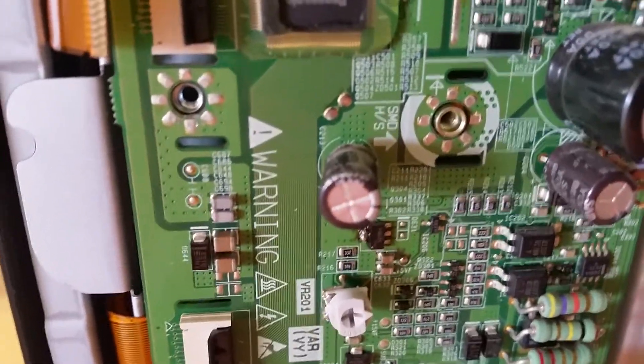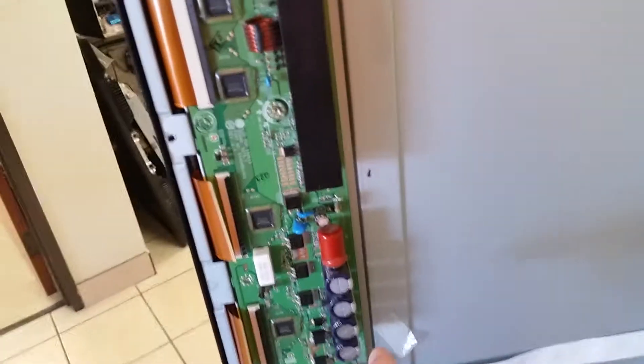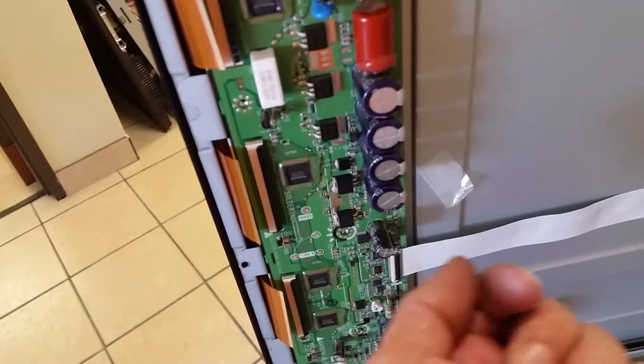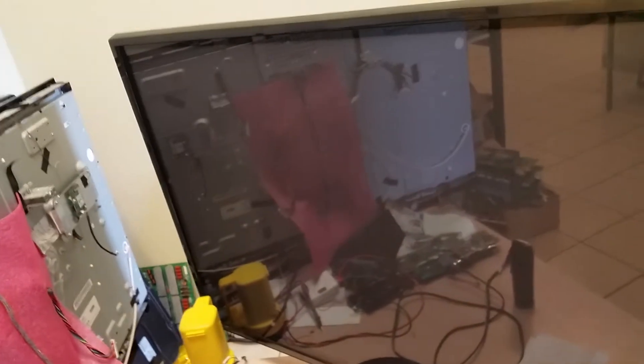You can see where we've soldered. It was like 12 ohms on that, and while chasing where it came from, it suddenly disappeared. Nothing was replaced on the board. The only thing I did — I remember — was I tilted one of those electrolytic capacitors a little bit because it seemed like it was at an odd angle. I don't remember which one it was, but that's the only explanation for what it could have been.